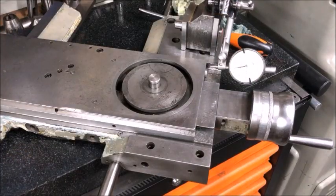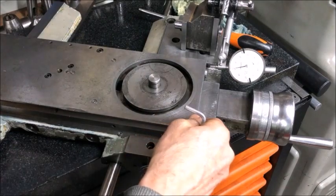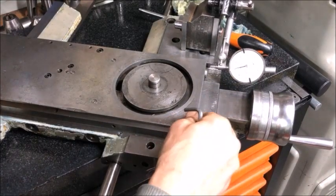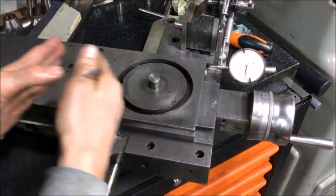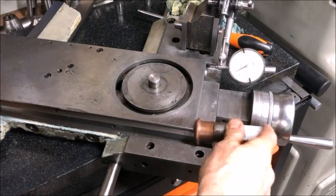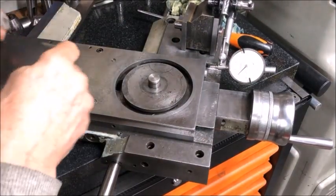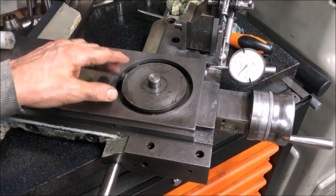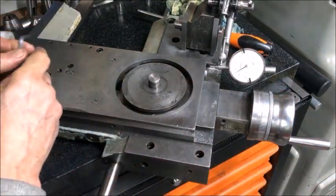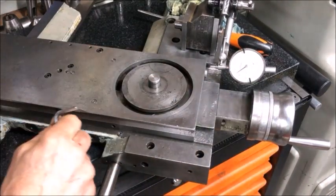Just snug enough to function. The backlash is adjusted and then measured with the test indicator — I move the slide back and forth, and then incrementally snug it up, forcing these two nuts apart. Just moving the slide a little bit, tightening, and moving in until I get the desired backlash. It's an iterative process, so you repeat it until you're satisfied.